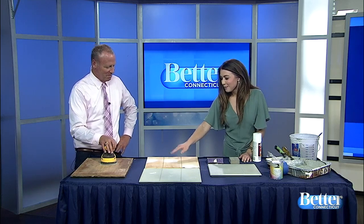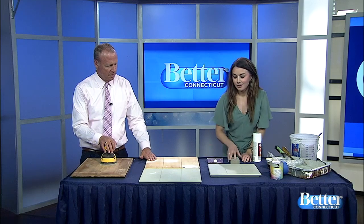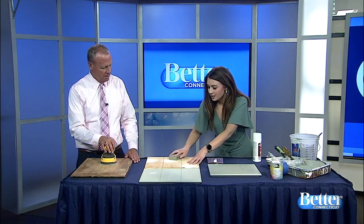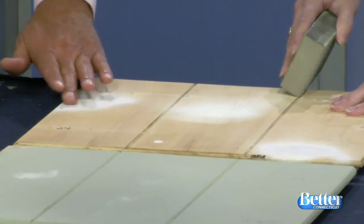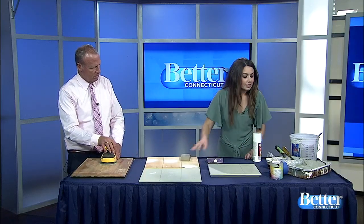So here's where I primed the knots. One coat of paint, then I sanded it back down using a block sander — you can just take your block sander and sand right over the primer. Then you spray the knot primer and sand over it.